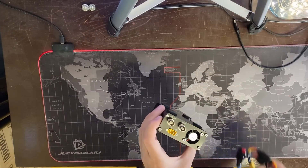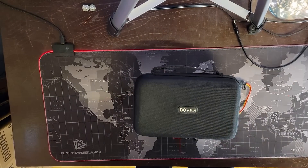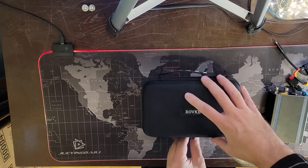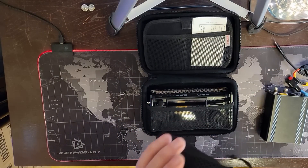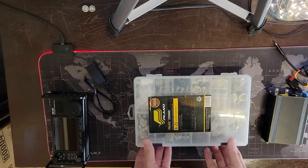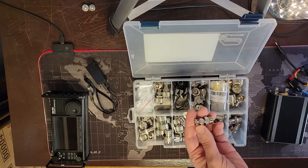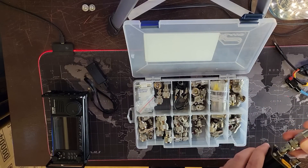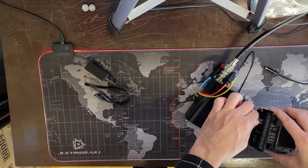So now we need to gather some adapters, some cables, some fun stuff, and a radio. Of course, the radio of choice is going to be the X6100, but this will just as easily work with almost any other radio out there that is 5 watts or less. What kind of ham are you if you don't have a big batch of cable adapters? From the DX Commander, I need a BNC adapter. This will go on to the antenna out side. BNC jumper goes to RF in, and then it goes to RF out.